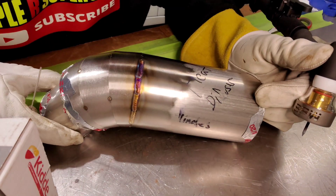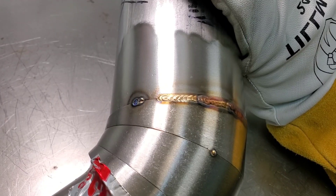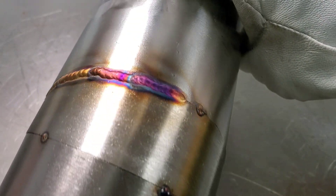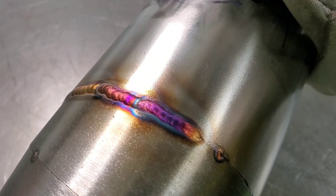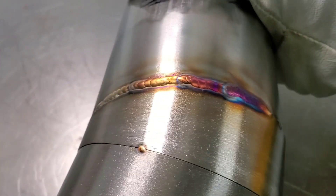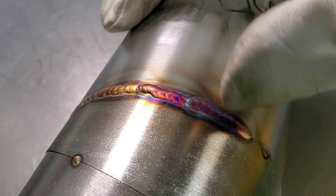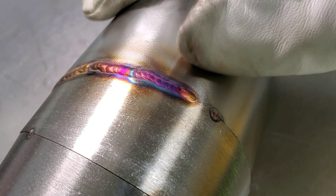Get ready to get that peacock, that darker purple shade. So you're going from a lot of gas coverage and then slowly taking it away — you start to get to a darker, golden color. Take it away sooner, you have that purple. And then a little more sooner, you're starting to get into that violet purple color, which is such an attractive color, especially on a pie cut or a car part. It's all in timing — timing of your heat and your gas coverage. If you wait longer and keep that gas coverage on it longer, it's going to keep the weld protected, and then while it cools down, it's going to go into your hay and gold color. Pull it away sooner, you get this color.